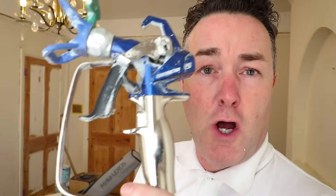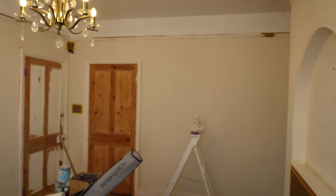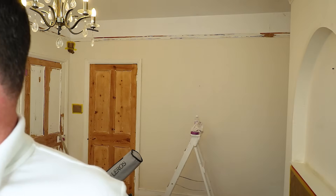I've got a 310, blue filter, on a lovely gun and I'm spraying. You're going to say, what pressure are you spraying at? I'm going to be looking at 1,100 to 1,200 PSI. As long as I haven't got tails, I want to be spraying at a low pressure — hopefully about 1,100. Just over 1,000 on the machine. I did a bit of a sample on that window — no tails on that, and that's just over 1,000 PSI spraying neat paint.